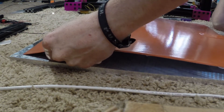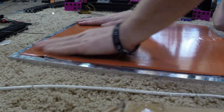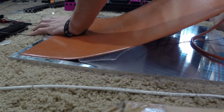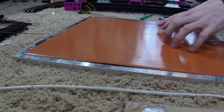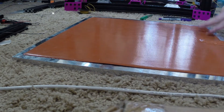I'm going to stick this heater to the build plate — and I swear I cleaned this beforehand but clearly I didn't do it well enough. It's a self-adhesive silicone heater meant for heating up steel barrels. I just line it up with the marks I made, stick it down, then slowly peel off the protective backing and stick it nice and solid to the aluminum plate. Since this is the underside, the thermistor and attachment points are all off at the edges because there's no way to attach them underneath the silicone heater.